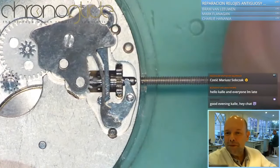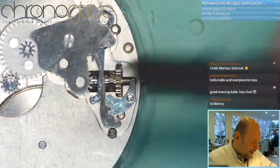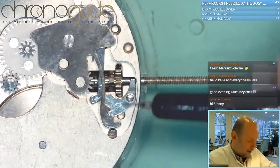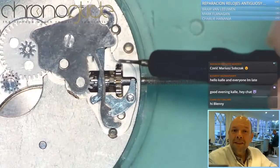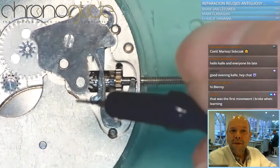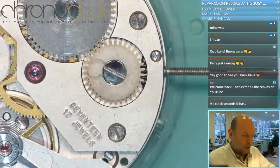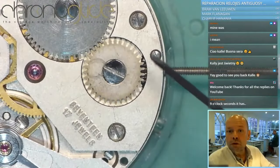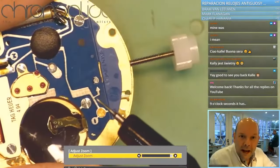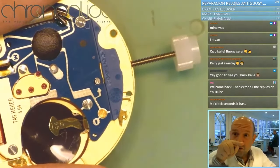There's a slip — I will show you a bit more about that. If I pull, you can see the sliding pinion went from that position to that position. Now the winding pinion is stationary and I'm setting the hands via this way. To release the winding stem there's always a small screw, or especially with quartz movements, an arrow pointing or a small lever with an indentation — a small dip.